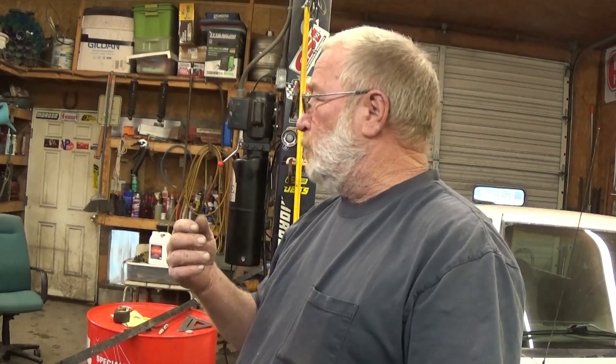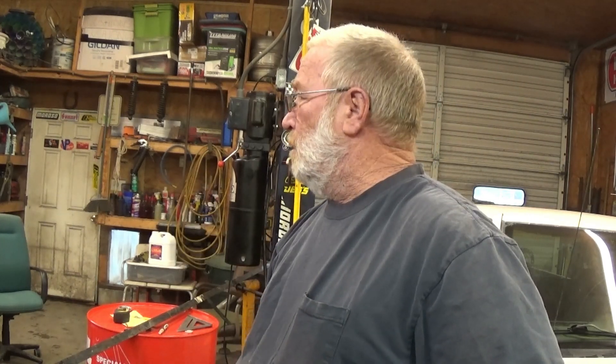I think I'm going to try to purge it with air while it's cooking. I don't know how this is going to work, but I saw it on Google so it's got to be true. That PEX pipe — half-inch PEX is good for like 800 psi and around 300 degrees in temperature. Well, I'm not going to hit neither one of them. I'm always going to be more around 200 degrees on the temperature and whatever air pressure it takes to make bubbles come up. I might have to use some black iron or copper or something.